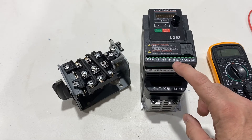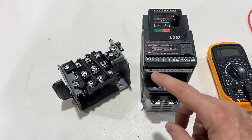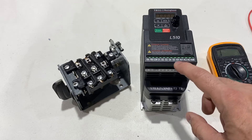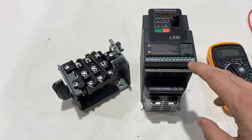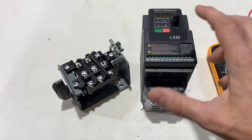I'm also going to have an external potentiometer for speed control. You can't power anything with this 10-volt supply — all it does is send a signal through the contacts of the wiper. If you use an analog voltage input and analog ground, that would be your potentiometer, just supplied by 10 volts. That's just how the VFD sees the speed signal.